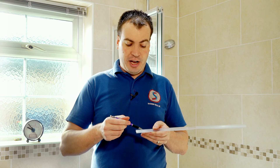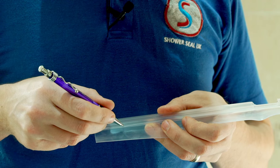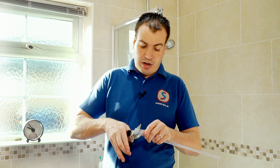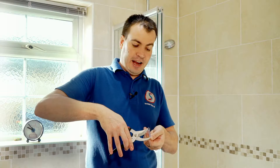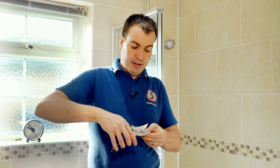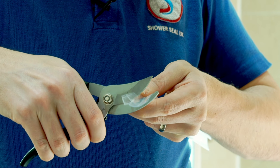Now just to show you — it's exactly the same technique but just doing it at the end — if you've got a hinge at the end of the door or a frame and you need to cut this section out, again we just mark a line on the seal. Take your cutters and curve the fin up like so. If you leave the fin hanging down you do risk cutting through it, so curve the fin up slightly, then cut down, being very careful not to cut through the fin itself.